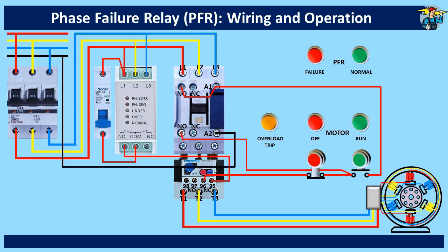To show that the motor is running, connect a wire from A1 to the motor run indicator lamp, and add the neutral line to the lamp. To show the motor is at stop position, we use normally closed auxiliary contact points on the magnetic contactor. Connect the bottom terminal of the NO contact points to the bottom terminal of the NC contact points, then connect the top terminal of the NC contact points to the motor off indicator lamp. Connect the neutral line to the lamp.